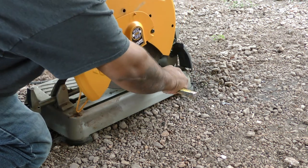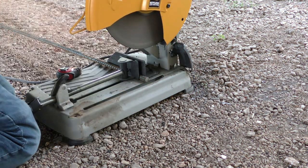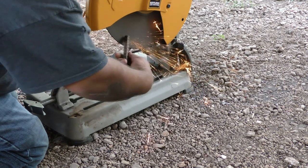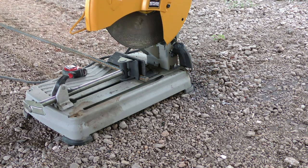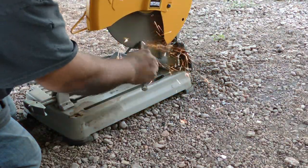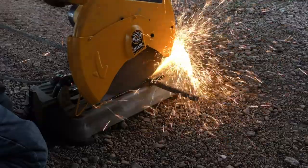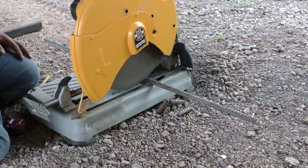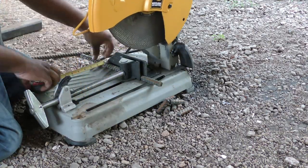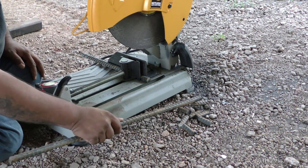After I cut them I clean up the burrs a little bit at the ends. This is not really the safe way to do it and I don't recommend doing it this way, but it's just how I've always done it. The cutting wheel I've got is a little bit too big for the metal I'm cutting, so I'll swap it out with a thinner blade which leaves fewer burrs. Right here I'm cutting the 2-inch little studs — I've already got quite a few cut. These are going to create the 2-inch gap between the base plate and the actual handle.